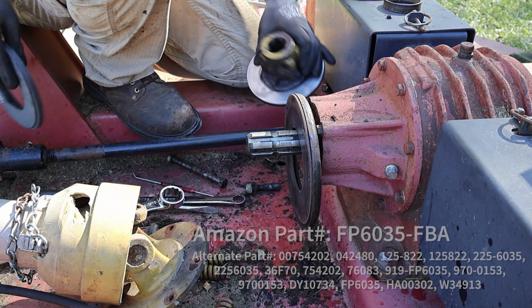We've tested or checked all eight of these. So they're all to spec. So at that point, we're good. Remember, we torqued this nut here down to 106 foot-pounds. And we'll go ahead and mark it just for posterity. So we will go ahead and put this little carrier bearing back in, get it bolted down, and then there's the plate. I don't know where I set it at, but there's a plate that goes on top of there. We will get it put back into place and then clean up, and we should be good. And again, this should also be 106 foot-pounds because it is also a 3/4-inch bolt.